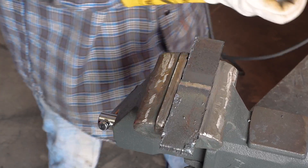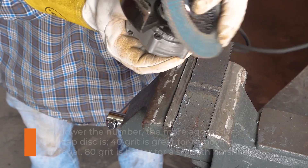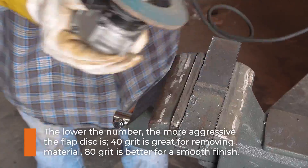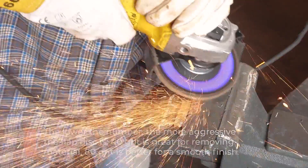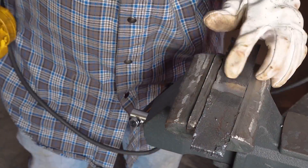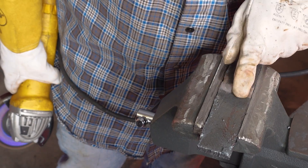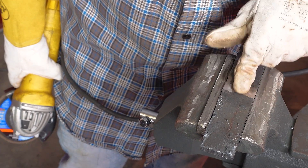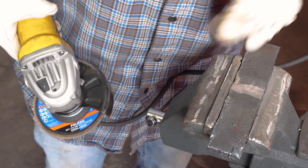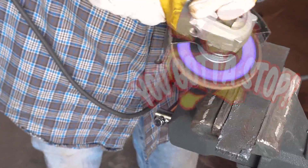We'll hog down the meat of it and then switch to a flap wheel. I like an aggressive flap disc — about 80 grit, I usually run a 60. You want to blend it down to the base metal. If you see a spot you can chase it a little bit, but you can't gouge into it. When you see something like that, try to get rid of it, but if it gets deeper and deeper you've got to stop — there's eventually a stopping point.